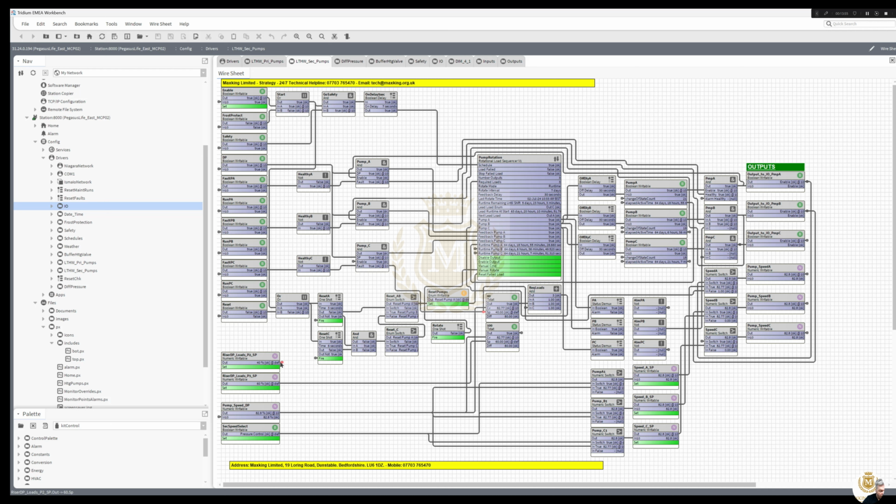This one is again down to loads, and same logic, we'll always be using 3 pumps. But we could lower that 60% down, and we could just go to 2 pumps, but at the moment we are using 3 pumps. Now the 40%, sorry, I'm just trying to work out my control variable there, which is the pump speeds. So that's my control variable for that system. Like I said, this has been tried and tested and it does work. And I'm not envisaging any changes to the logic at all.